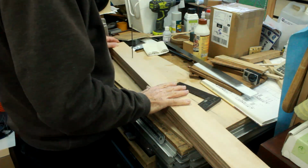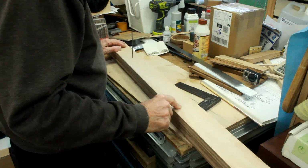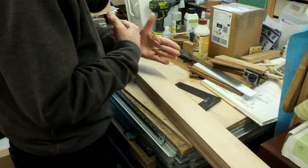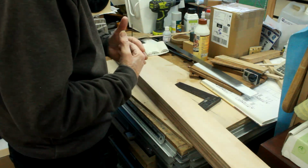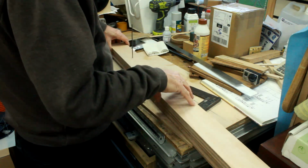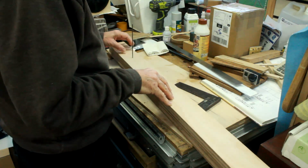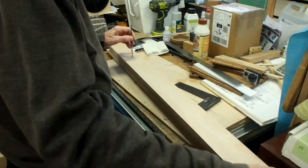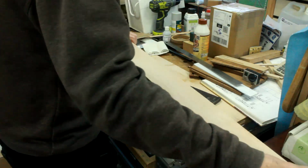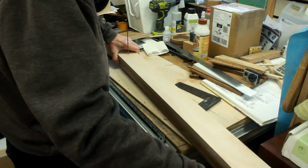I need 6 because there are 3 boards, they've each got one long face, but I only have mating surfaces on 2 joints, if you like, so I only need 4 boards that are all exactly the same in terms of matching up with one another. To that end I've drilled 3mm holes, one at each end, in 4 of them, so they're like 2 matching pairs.